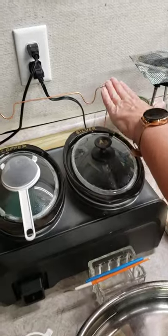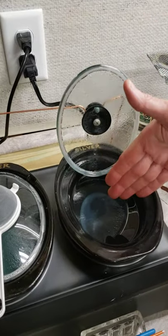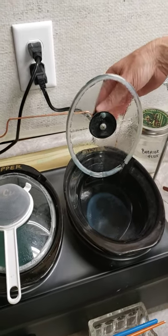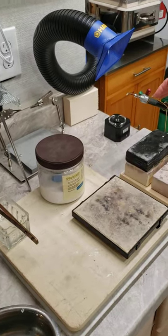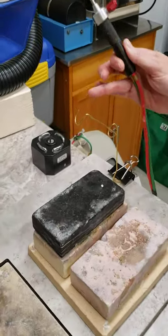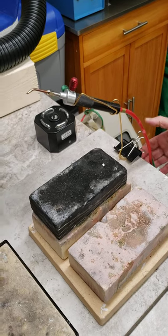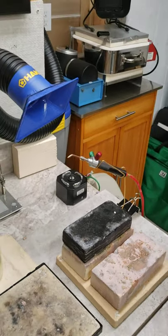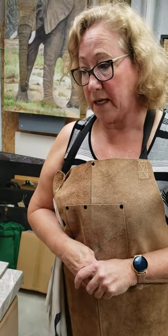So that's what I did on both of these, so I won't have any steel contamination in my pot. I also made a nice wire holder in the back so that when I'm working I can easily lift up my lid and drop it in there and let it drip right back into my pot — it's out of my way, not on my table anywhere. It's kind of a DIY thing, and I also made my own little holder for my Smith Little Torch. I just formed it around the handle and used a paper clip clamp to hold it down.